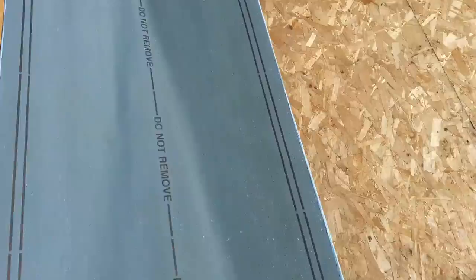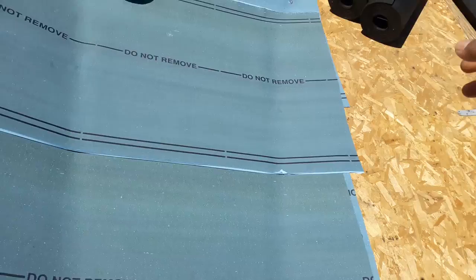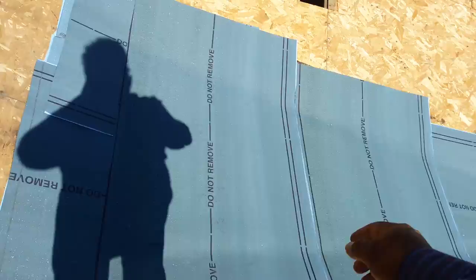Don't forget to put nails when you finish on top of this, because for some reason with hot mop or torch-down, when you don't put any nails on crickets like this, the membrane wrinkles. So put nails along the top all the way across — at least two on each sheet. That's going to prevent the wrinkles and keep it smooth for the next 20 to 25 years, so nobody calls you saying your membrane is wrinkling. Play it safe.